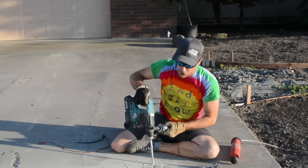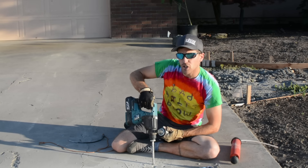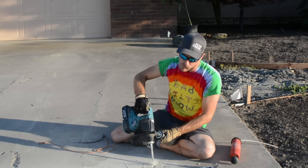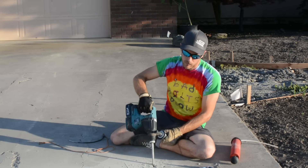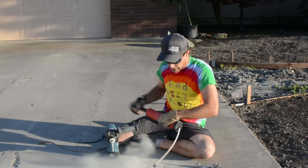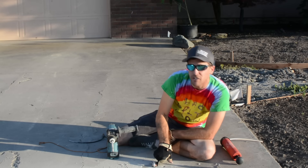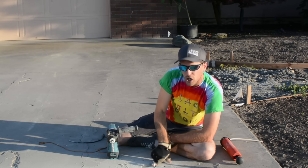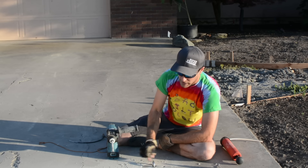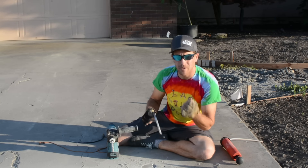The other option is to start at the hole — I do this more often than not. Start here and then start to tilt it. I have to keep checking my notch until I know it's right. That's actually really flush with my concrete, leaving the metal just a little bit above the concrete, so the rope will be rubbing that smooth metal instead of rough rock. That right there, after it's all filled with glue, is going to be a really great bolt. And it's deep enough, but I'm not going to waste a lot of glue because I over-drilled it.